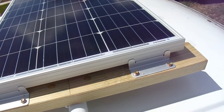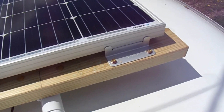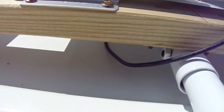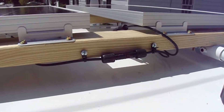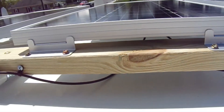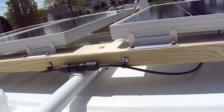Pretty soon we'll start wiring. I've got one here, there should be another one right in here. I think this is negative — because negative is a female connector and positive is a male. So it's going to be run in series, negative to positive, all the way down. We're running this in series, positive to negative. I have a negative here to hook up to the long wire, and I have some zip ties with an eyelet on the end that I use to secure the wires up. They won't last forever, but they'll do for right now, because I may be changing this or maybe adding another panel.